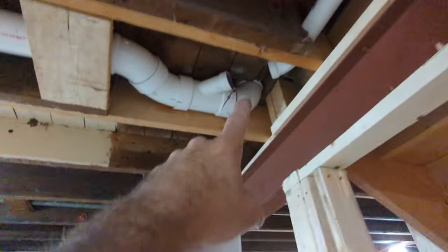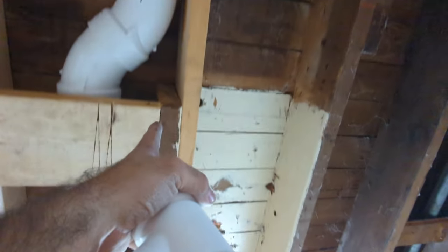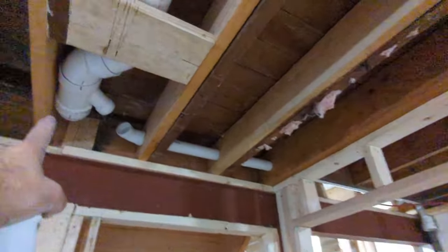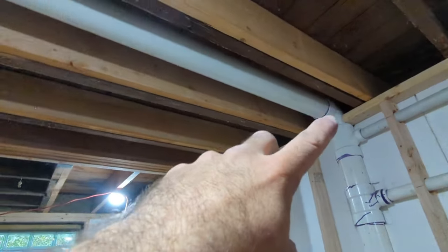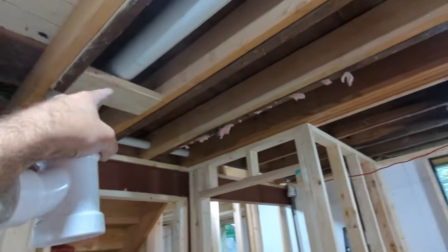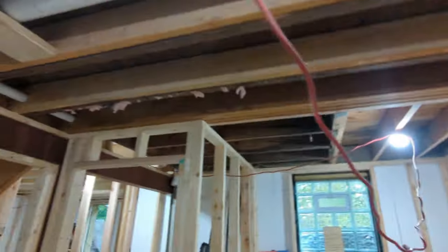Over here, on the other hand, has been all glued. We had a dog leg to move away from this joist because our center line from the stack was going to put us tight. So we dogleg over, we ended up in the middle here, and got that. I put this up high enough so that that could be a street elbow. And then I built this whole thing out to there. And then we could put this leg with that street elbow on it already, go up in there, and then juice up that upper hub, juice up this horizontal hole over here. And then go into that until this went set down in there, because I have some ability to go past in these ends and stuff, so that was ideal.